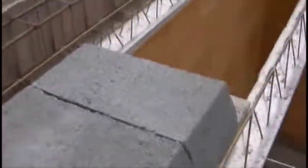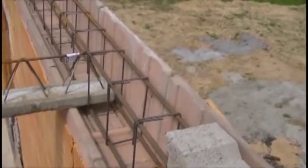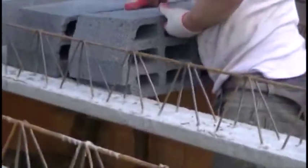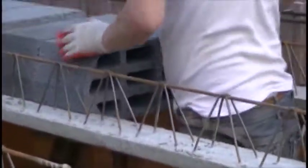Please note that from its bottom side, these blocks have locks allowing the suspension between the beams. The first beam must be placed directly next to the rib. On the other side, if you fail to hit the distance, you can arrange, for example, 2 beams or make a small shuttering. After preparation of the beams, all that remains is to fill the empty space with blocks. This process runs very smoothly and quickly.